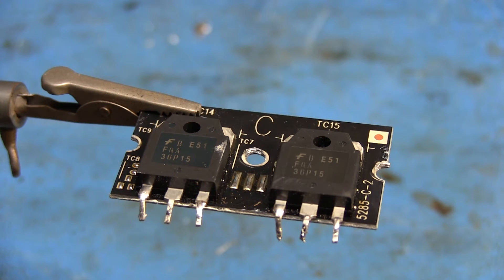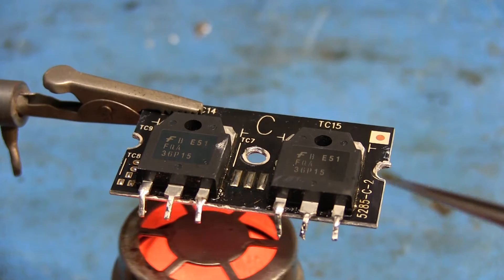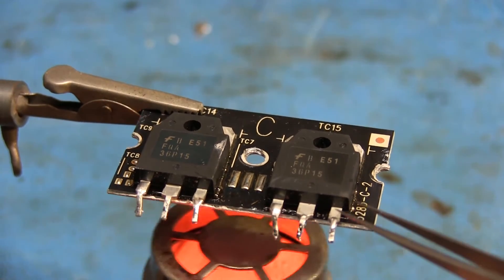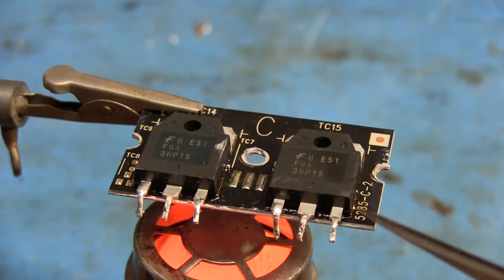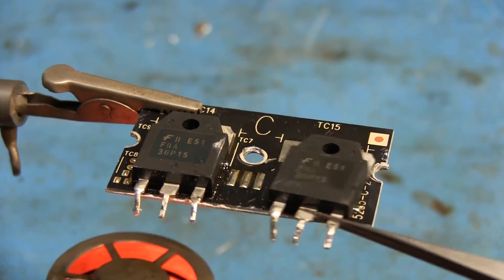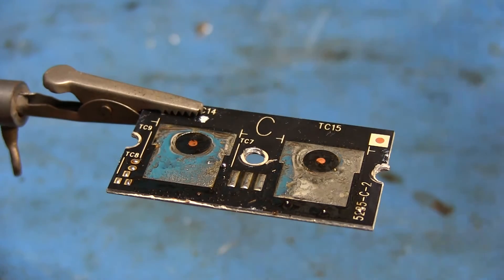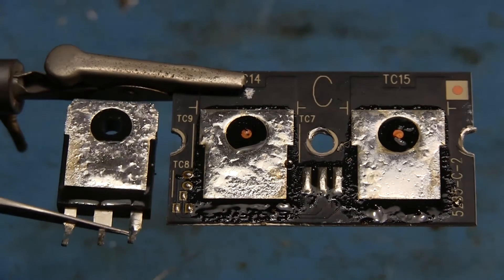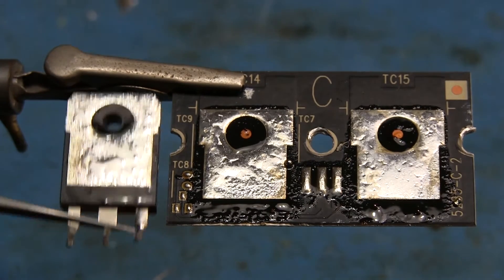There's going to be a little bit of solder on there so it gets pretty hot. You can see some of the old flux is kind of bubbling up underneath, and I give it a little poke just to see when it loosens up. They're not quite loose yet so I'm going to keep heating a little bit longer and probably switch to the high heat setting on the heat gun. There it goes — once it's up you can just pull them right off.